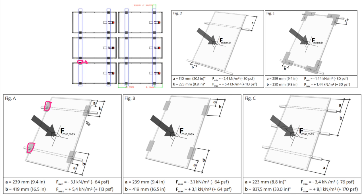In utility scale trackers, they might locate the clip in the middle of the panel, but the clip itself is going to be like 2 feet long in that case. When you're putting them up on the rooftop, the clips are very small. They might just be an inch or two, and instead of being right in the middle of the panel, they're on the edges. There are specific rules that govern how far from the edge you can clip. Generally speaking, it's about 8 inches or so.